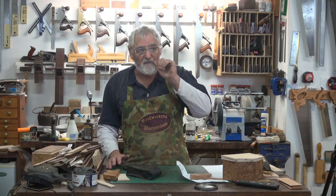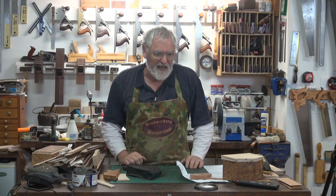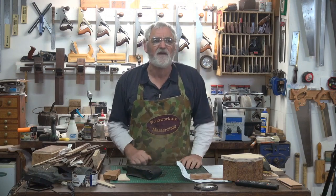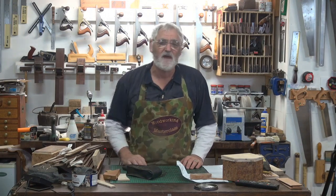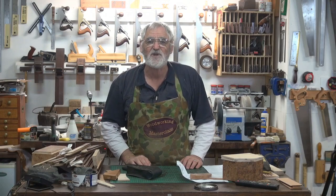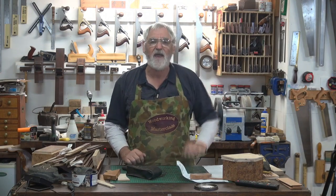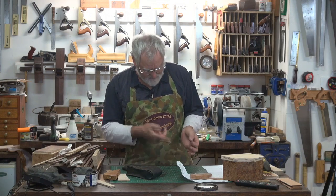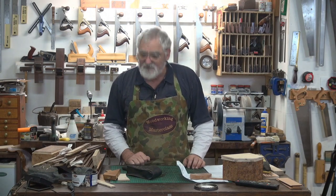The pins that the reed valve or flap valve sit on were hardened steel, so I went up to the blacksmith shop and gave her a nudge on the anvil. Didn't work. So I thought, well, there's no pressure on it. There's hardly any heat. There you go. Half a tube of super glue. Put the spring cover cap on. Held it down for a couple of minutes. Didn't come off. Flapped on it. A little bit stiffer than it was before, but that'd be right.